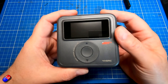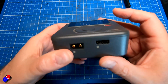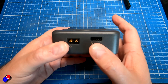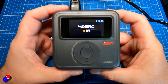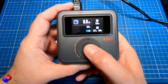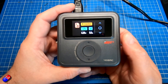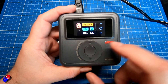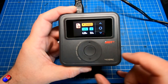Here on the bench let me show you the interface — it's very simple, really aimed at those coming into the hobby and wanting to keep things as simple as possible. We'll plug it into the mains, get the welcome message, and then the default screen. To change things, press the middle button, then use the two up and down buttons. We get the current settings: charge set for LiPo, a 4S battery, the voltage per cell, and the charging current.